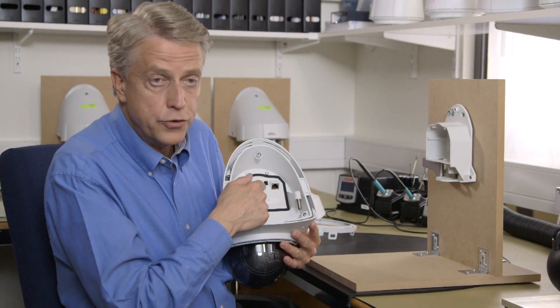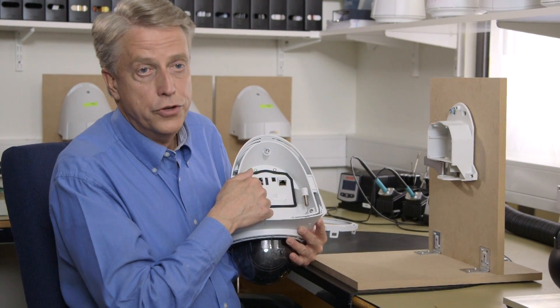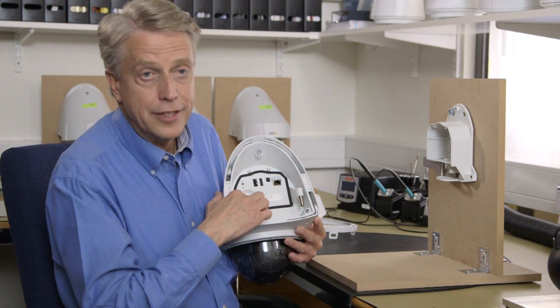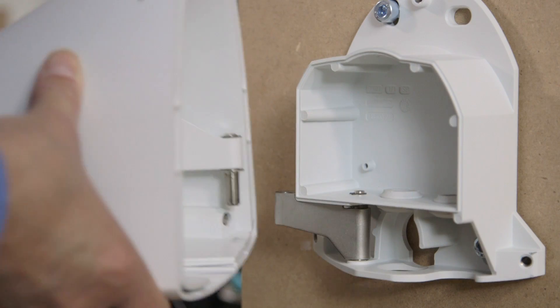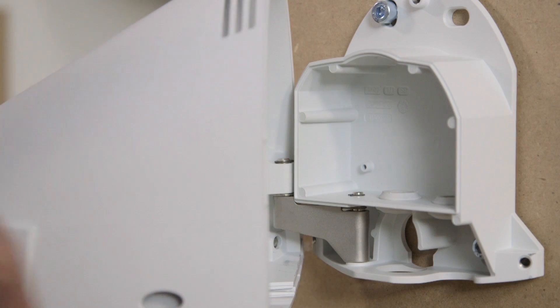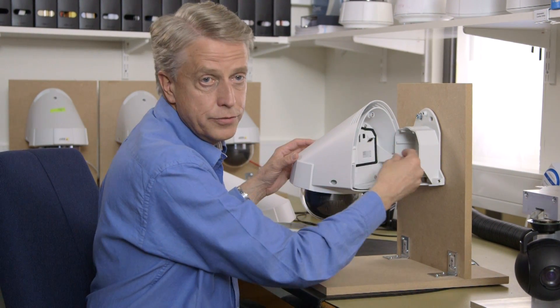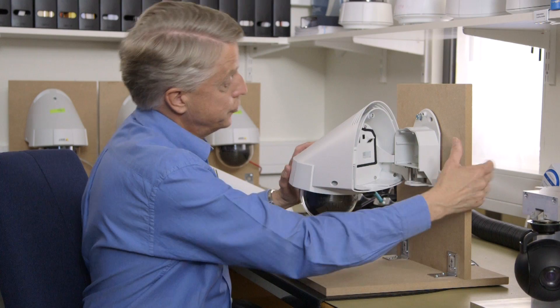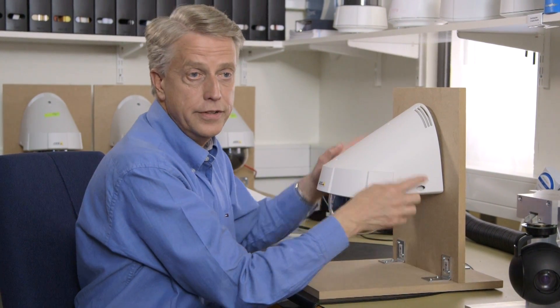You have the power, if you're not using Power over Ethernet. You have I/O and audio. You also have an SD card for memory. You take the camera, you hook it up on the hinge. Now you have both hands free to connect your cables to the camera. When you have done that, you close it, and you fasten it with these three screws. And you're done.